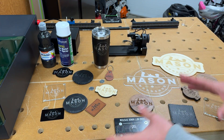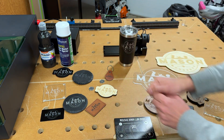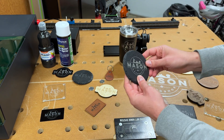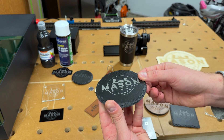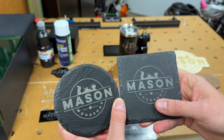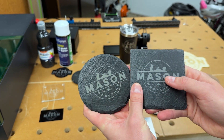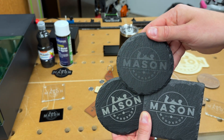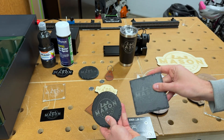I'm not going to go through all the material capabilities, but here's a quick comparison. Over here we have what I've done with the S1 and over here are some P2 examples. This is a stone coaster off the 20-watt laser — I did put a bit of lacquer finish on it — and it turned out absolutely perfectly. Comparing to the CO2 laser, it's almost the exact same level of detail on both. Different types of lasers give different colors on the engraving — here's one from the 2-watt laser which is a little darker. For stone coasters, the S1 is just as capable as the P2.